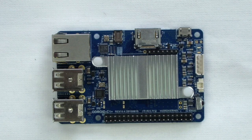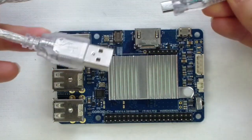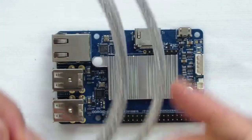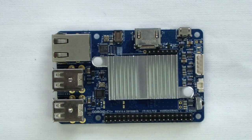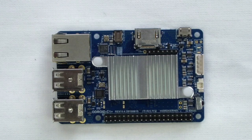In addition to allowing power input with a 5V 2A smartphone-style charger, the microUSB OTG port is designed to allow the resources of the Odroid C1 Plus to be accessed from another computer. With the addition of the microUSB to host cable adapter, this port can also be used as a fifth USB 2.0 host port.